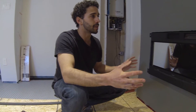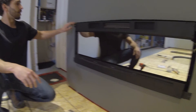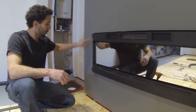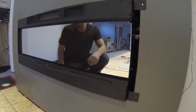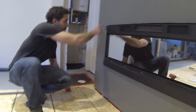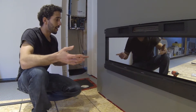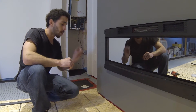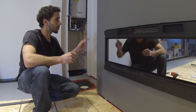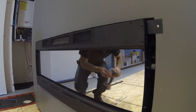When you're putting the fireplace in, make sure that you have two people doing it — one person on either side. Then all you have to do is put four screws into these brackets. The way I framed this, I want to make sure there are studs surrounding the entire opening. Depending on the way yours is, you may not have studs there, and if you don't, make sure that you use wall plugs — because if you just have the screw hanging in the drywall, it's not going to be able to support the weight of the fireplace.